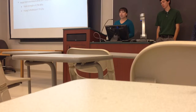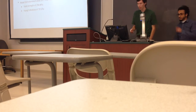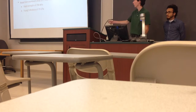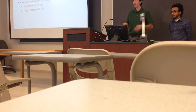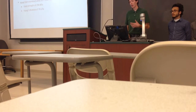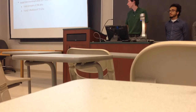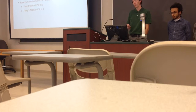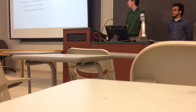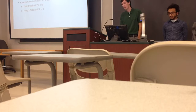So here is my teammate Nate with the base. Thank you. Good morning. The base will be supporting the entire robot, also the Arduino board and all of the micro switches and balls. It features a housing to hold the lower stepper motor and pulley system, and also supports the Arduino board. We're making it out of aluminum alloy 2011, and it has 4 aluminum legs at the corners. We chose 2011 for its ease of machinability.